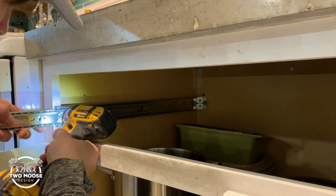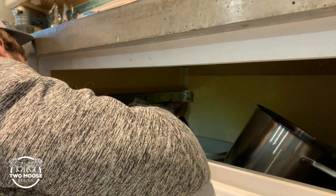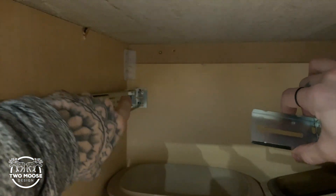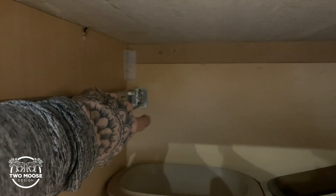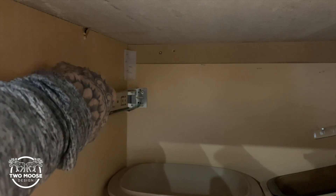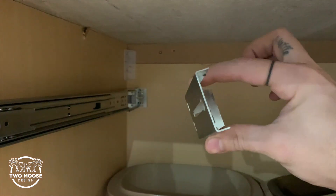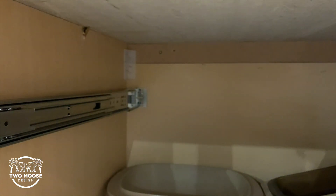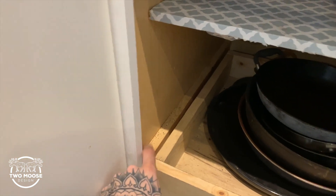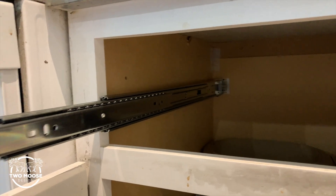I was originally going to do a rear mount bracket, but because the back panel was only an eighth of an inch thick it didn't feel sturdy enough, so I ended up going a different route. The slide goes into the back like that, but because this back panel is so thin I don't really feel good about it — once the drawer is loaded up I feel like it might pull out. So I'm going to trash this idea and add a piece of scrap wood to the edge here to make sure the slide stays nice, square, and solid.